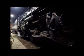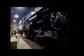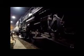However, when the train's moving, the steam from the steam chest exits through the nozzle and shoots out the stack and mixes with the smoke, and it shoots the smoke out of the stack too. And this creates a suction of air through the tubes, which creates a draft on the fire and can make it even hotter. Thus, the steam that you're using to make the train go will make the fire hotter, which means you have to add more coal to fuel it, and helps you make more steam.